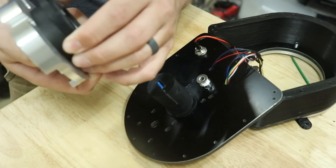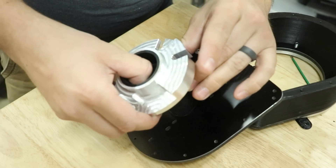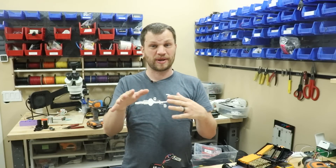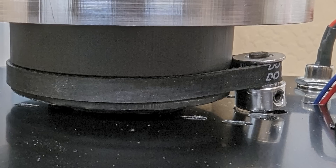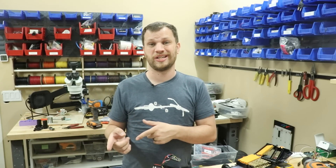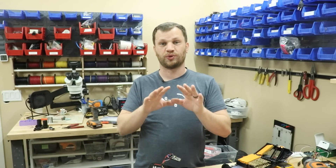I've got the sprocket installed on the motor and the pulley that goes around and spins the rotor. I did a belt calculator online to try to get the right ratio so that my 200mm belt would be a perfect fit, and I left myself a little bit of room so that the belt wouldn't be too tight. But my calculations apparently weren't that accurate because the belt is really just too tight — it's putting way too much friction on the sprocket and the motor is having trouble spinning.